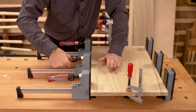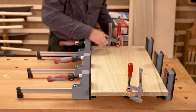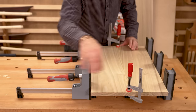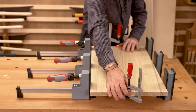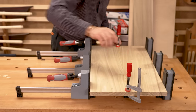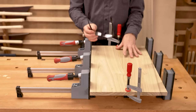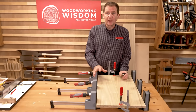That's come together. This one got a bit of twist on the board. I want it flat if I can. Again, checking our ends. Tiny bit maybe. And I mean, it's minute. Probably wouldn't show. But let's have a pull. Oh, that's better. Do our clamp back up. All right. So that we can leave. Let it go off, let it dry. That's all we need. All right. Having glued it up, we just need to now let it dry.